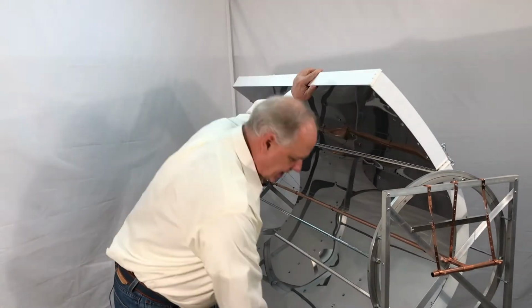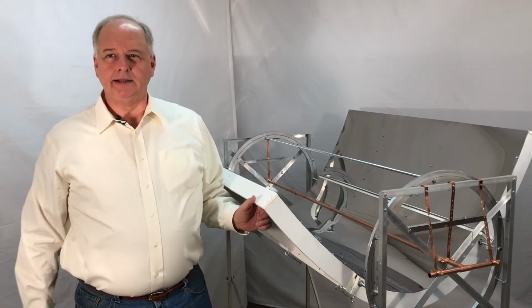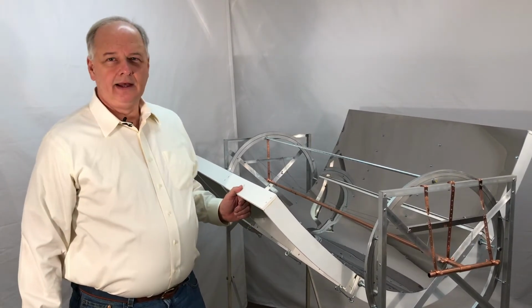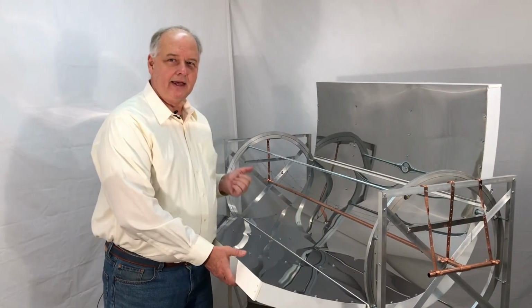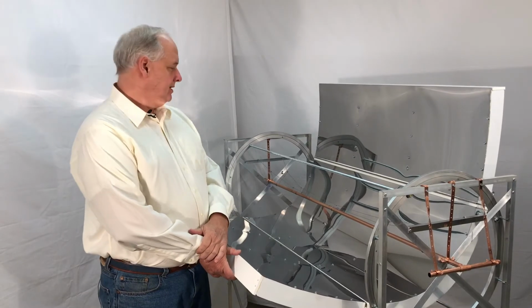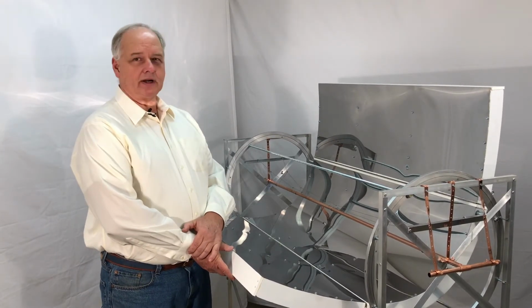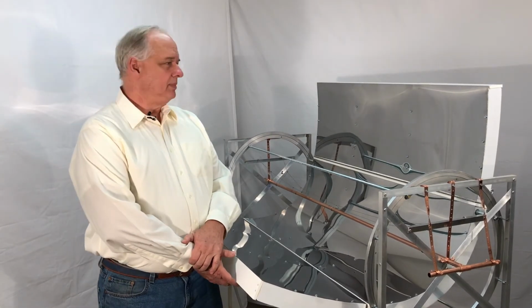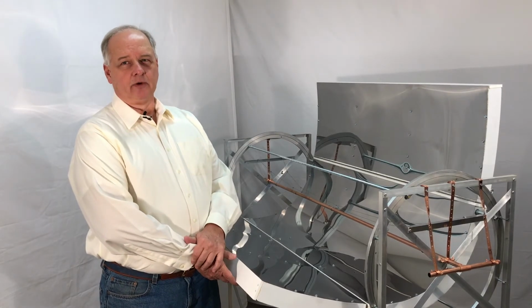I brought this device out a few days ago, and the air temperature is about 45 degrees. Less than a minute later, I touched the collector tube and pulled my hand away. I put a thermometer on the collector tube, and it registered 200 degrees. Not bad for a 40-inch wide mirror on a 45-degree day a few weeks before the winter solstice.